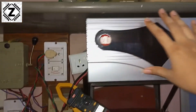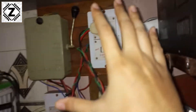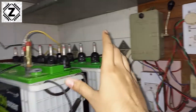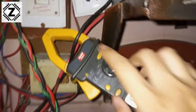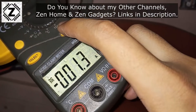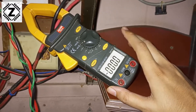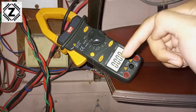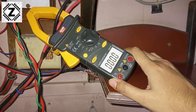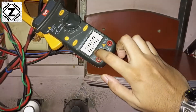At this moment, this inverter is absolutely disconnected from the load as well as from the mains section, but it is connected to this giant battery bank using these thick DC wires. To measure the consumption today, I'm going to use this nice little trusty clamp meter. Let me hit zero properly so that we'll be ready to measure. If you want to buy a clamp meter like this one, I'll provide buying links in the description below — please consider using my affiliate links. So now I'll turn this thing on and we'll be able to see the self power consumption of this inverter.